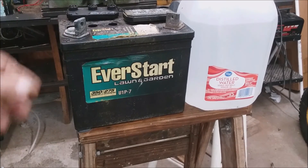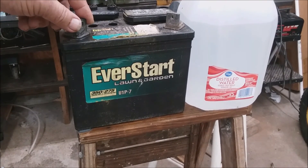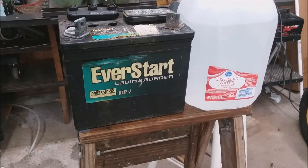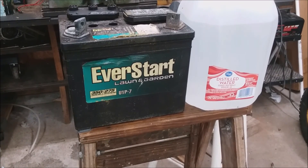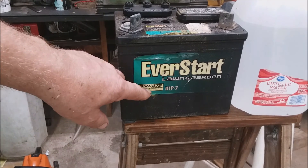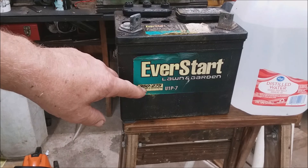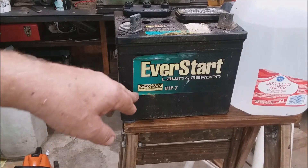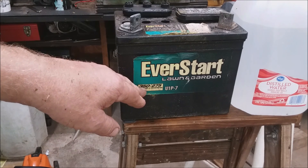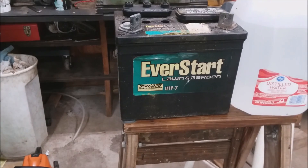Whenever you have a problem with a tractor, clean the battery terminals first. About half the time I've run into terminals just not being clean. Clean the terminal, clean the other one on the cable, and make sure you have a good tight connection — that will eliminate a lot of your battery problems. Batteries are rated on cold cranking amps. This one is 350 cold cranking amps at 32 degrees. The colder it is, the less current the battery can produce. 350 is pretty standard for most lawn tractors. My John Deere diesel tractors have 550 cold cranking amps — they need a lot more power to start a cold engine.